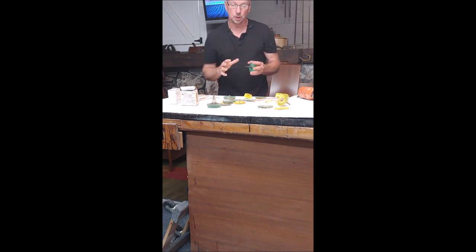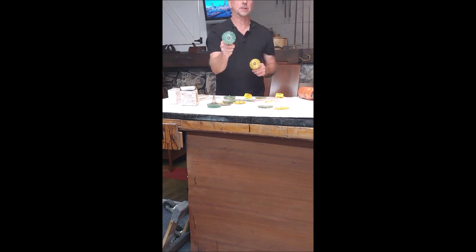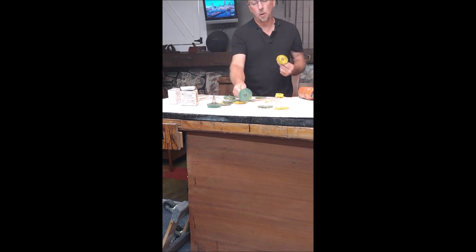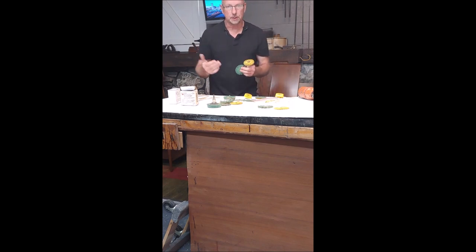If you find that they happen to strip off some shellac or something like that, great, but that's not what I would suggest they're intended for. We use them on raw wood in our shop and we use two different colors — green and yellow. I use green 98% of the time. The only time I'm using yellow is when I've used green first and I'm noticing it's leaving behind some markings because it's a really soft wood. If it's a really soft wood, the green is a bit more aggressive — typically that's what I want — but if the wood is pine or something really soft, the green might be a little too aggressive.